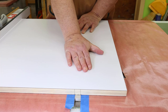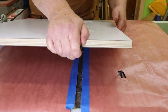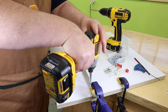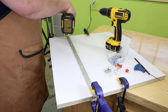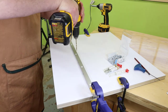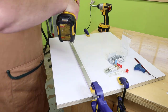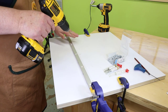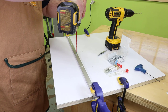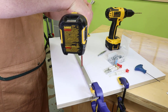It's better to be safe than sorry. Let's lift it up and see what happens — give it a little wiggle action and bingo, we're free. Let's get it over to the assembly table and put some screws in it. In order to get the screw holes well centered, I'm using a spring-loaded self-centering drill bit. I'm also going to remove the laminate from the top of the hole so I don't have any risk of it chipping out as I drive in the screws. When laminate chips, it breaks like a potato chip — you don't know how big the chip will be. Now we have the runner fully attached and the base is aligned perfectly to the blade.